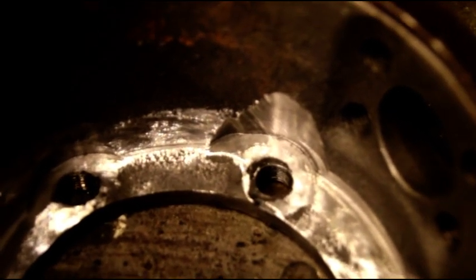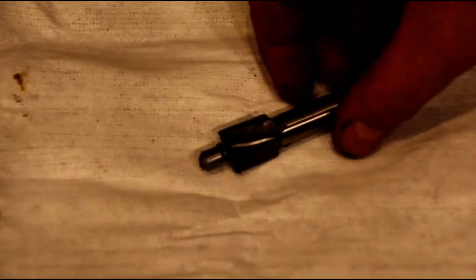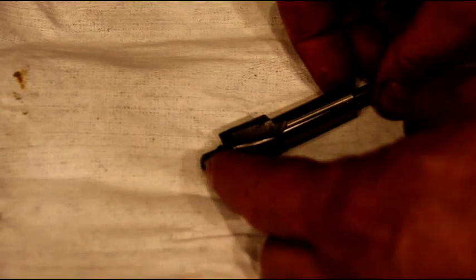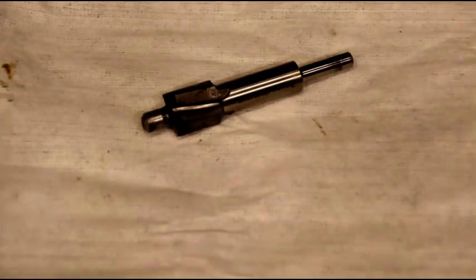And I'll show you what I've got going on. Here's my cutter — a standard counterbore cutter. It has a removable pilot, so you can get different sized pilots based on the thread you want to fit through. This is perfectly sized for that hole right there. You can get these at any machine shop supply house, any industrial house, anything like that. You just get the right diameter you need for your bolt head. We're going to go over to bolts next.